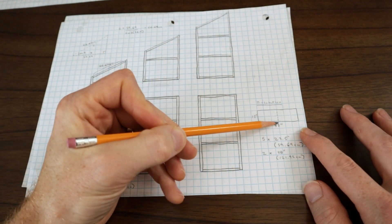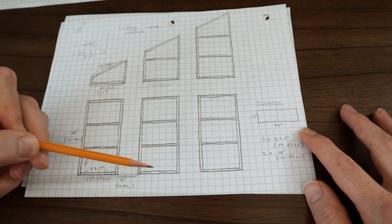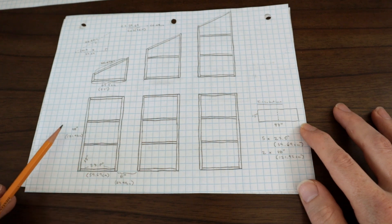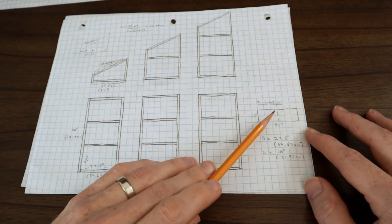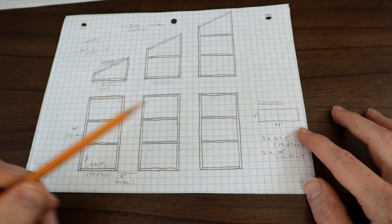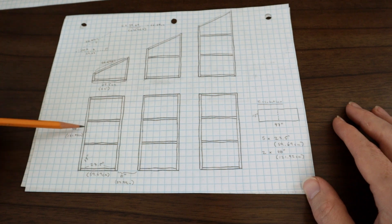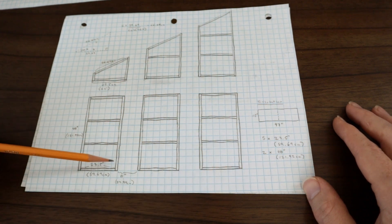So I designed the lower square panels with a 15 inch by 23.5 inch interior square. That means I can take my insulation, make one cut in half, and put a half piece of insulation right in each square — using all the insulation efficiently without a lot of cuts. Now if all you were doing was making square panels this would be super easy — no big deal to use inches. I can buy my insulation, buy my wood, cut all of these pieces at 23 and a half inches. I'm going to need five of those for each panel — the four sides plus one for the French cleat — and then two 48 inch pieces for each side.